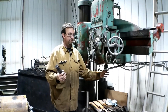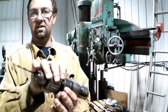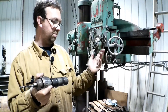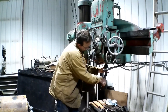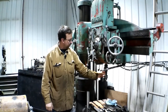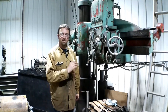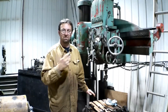I'm going to do one at a time — my plan is to put it on there, drill and tap it, put the head on, and then do the other two so everything lines up good. This is a pretty cool setup: it's a magic chuck, and you can set it up however you want. They've got these holders — just a morse taper holder — and I put in whatever I want. I've got multiple drill chucks, taps, all kinds of stuff set up, and you just lift this collar, slide it in, collar drops down, and you're there. It floats a little bit so it'll help you line up your hole. I'm going to hand tap it because this is hard material and I don't want to break my tap.